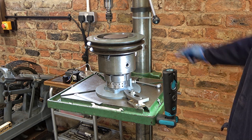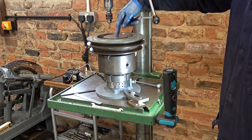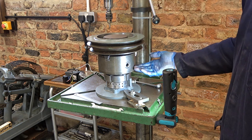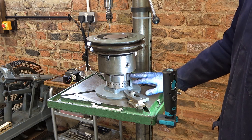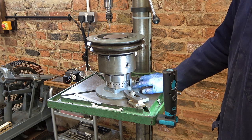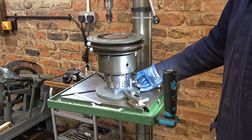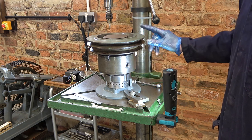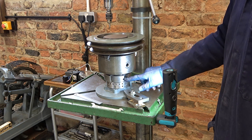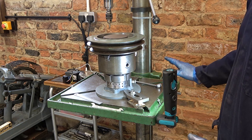It's time to drill the five holes and thread them to secure the shield disc on this end to protect the end bearing. I'm using this indexing rig and I think this base is probably one of the best things I ever made. It's indexed in two rows — tenths and twenty-fourths — with a little spring lever. Mounting this on the chuck via an L00 taper means it will take any of my chucks or face plates.